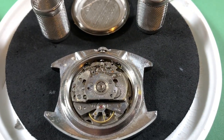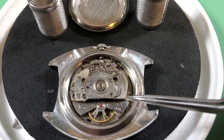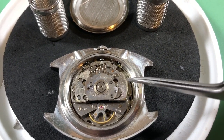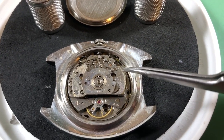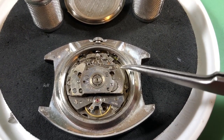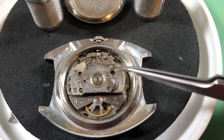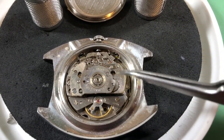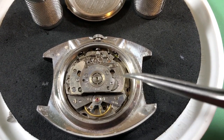Well, first update. Your father was an active man. We can see that because we have this brassing right here. That's from the winding weight moving around a little bit, flopping around and hitting this edge. But we can also see that he was active because of something I don't see very often: all of these back screws are loose. See that? That bridge is loose. This entire train bridge is loose. That usually happens when somebody's really, really active in combination with a watch not getting torqued down all the way.